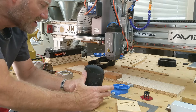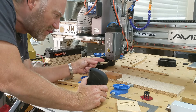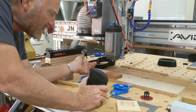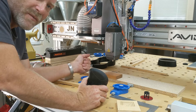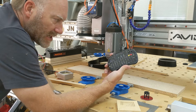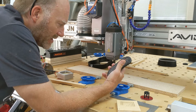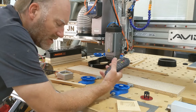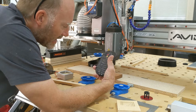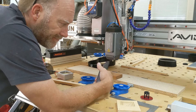So that's pretty simple. Sometimes I'll use the lower left corner of the workpiece — I'll just use the laser light and put half of the light on the edge, or over the edge. It's just as easy to find the center as the corner with the laser turned on. That's why I do it this way — because with one of these little portable keyboards and the hotkeys that turn the laser test fire on and off, it's just as fast as using the touch plate where you have to go back and do an offset afterwards. Here I'm going back anyway, so I hit X, Y, Z to zero it out and I'm ready to run.